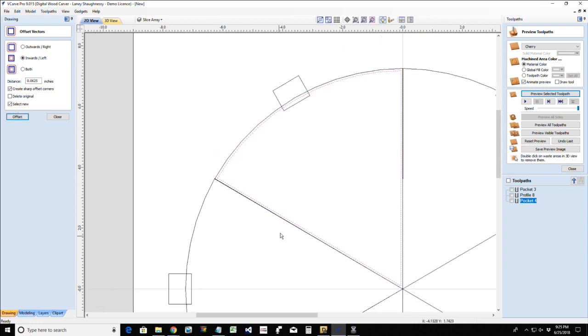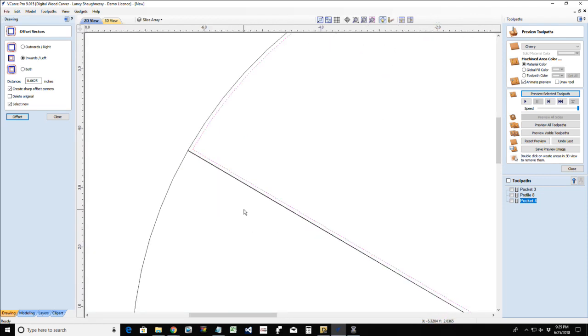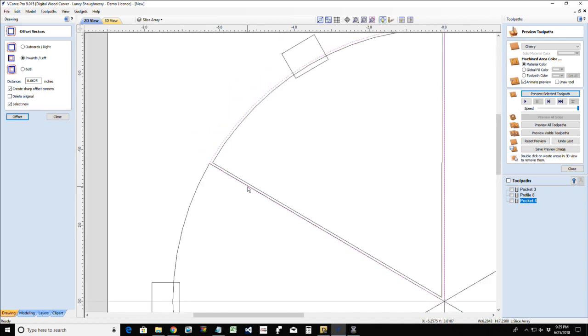There we go. Yeah, because we want to have a place for our knife to cut down in between. So a 16th of an inch. But each of these are going to be cut down a 16th of an inch. So a 16th and a 16th is an eighth. That's an eighth inch separation. A little bit too wide. So I do want to go a 32nd, because each of these are going to be a 32nd, giving me that total of a 16th of an inch. I'm so sorry, guys, to confuse you. I want my finished space offset for this to be a 16th of an inch total.